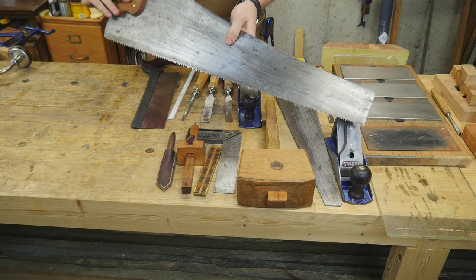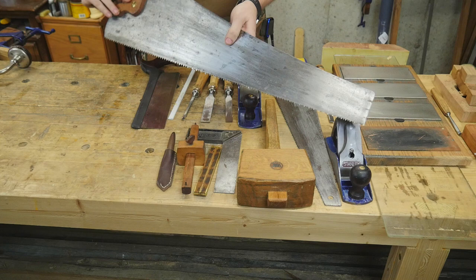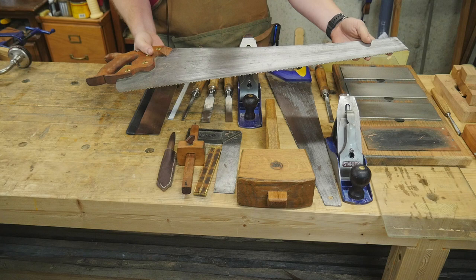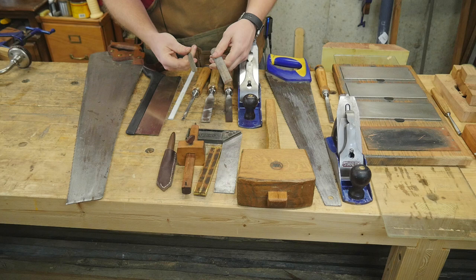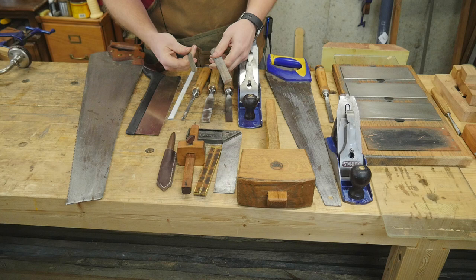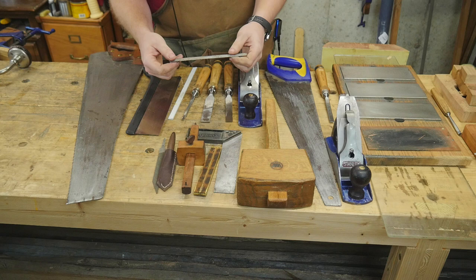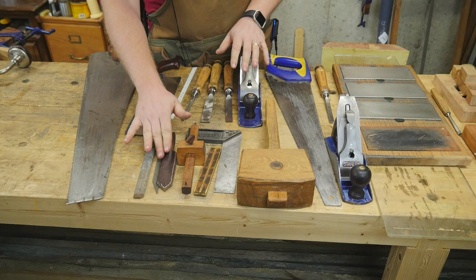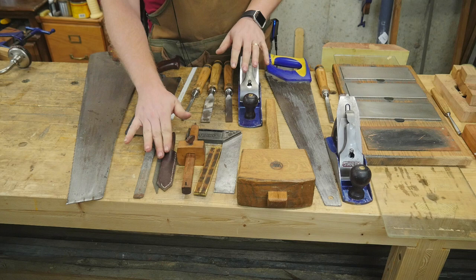You can then get into all of your other saws. Getting a large rip hand saw is a good thing — you'll find you get them kind of in pairs of rip and crosscut. A very large, heavy rip saw like this one is very useful. As with planes, saws kind of come naturally — you can find them all over the place. Once you get into saws, you'll start getting into sharpening, which means a good set of files. Getting a triangular file for sharpening your saws is a start, and then you'll naturally collect other files for different shapes and uses. You can find them all over the place at antique stores and garage sales.